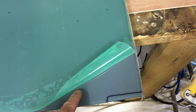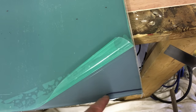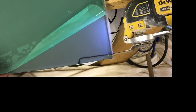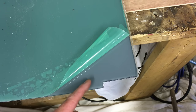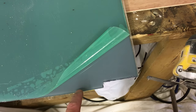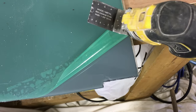Another one quickly is acrylic wall panels — the panels you fit in kitchens or bathrooms as a splashback. A lot of the times when you're fitting these you need to notch them around socket outlets and things like that. This tool is brilliant for that. Acrylic is notoriously difficult to cut because it chips and splinters quite a lot, but you find with the multi-tool you can cut it fairly well without chipping or splintering. So for cutting around sockets or even plunge cutting into the acrylic, the multi-tool is absolutely ideal.